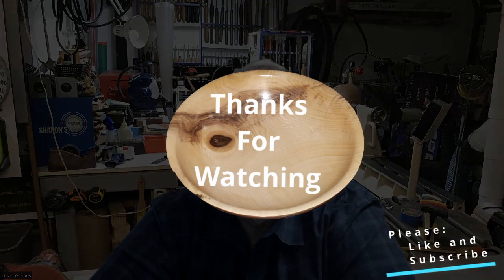When I first started years ago, that last cut really stunk. But that last cut is a mindset — you're thinking 'just one last cut' and then you're thinking about failure. What we have to do is start thinking: this last cut is going to make a fabulous surface that I don't have to sand. It all starts with taking your time and making sure you have a nice, fresh, sharp edge. And if you practice that last cut all the way through the turning process, that last cut becomes a whole lot easier.